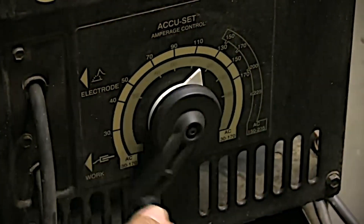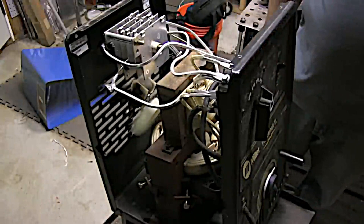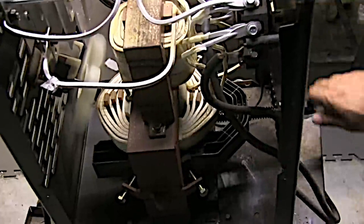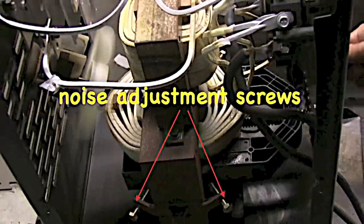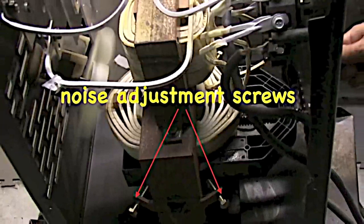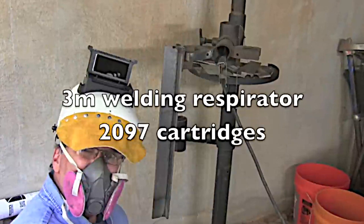This is the little amperage mechanism here. It's a Miller Thunderbolt and it's gotten loose. Here's what the machine looks like on the inside. The little shunt that moves back and forth to change the amperage has got some set screws on it, and in the manual they actually call them noise adjustment screws. When they get loose it buzzes like crazy and also won't hold an amperage. After tightening those screws up maybe half a turn, things got a lot better.